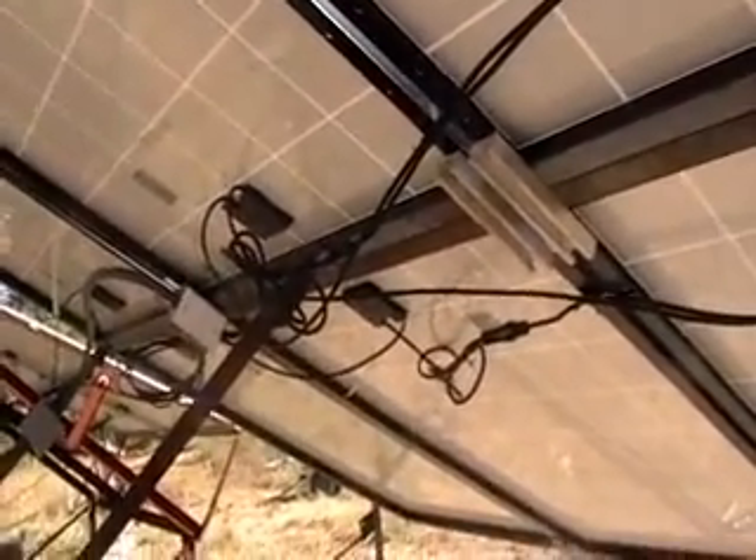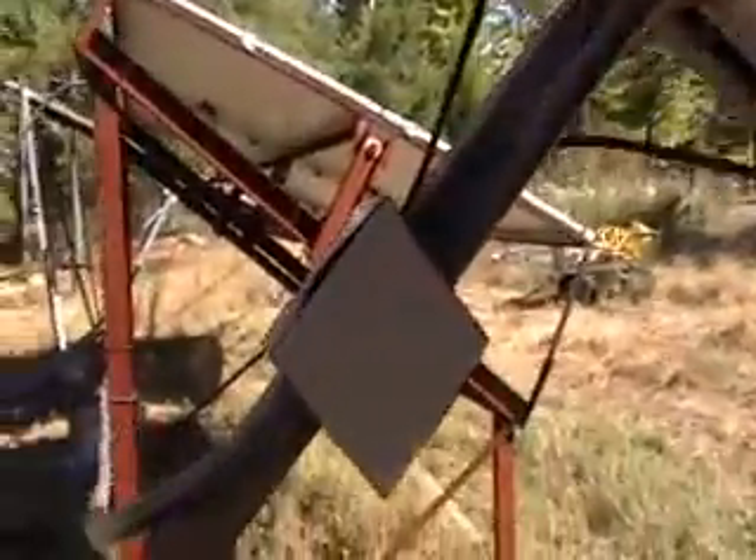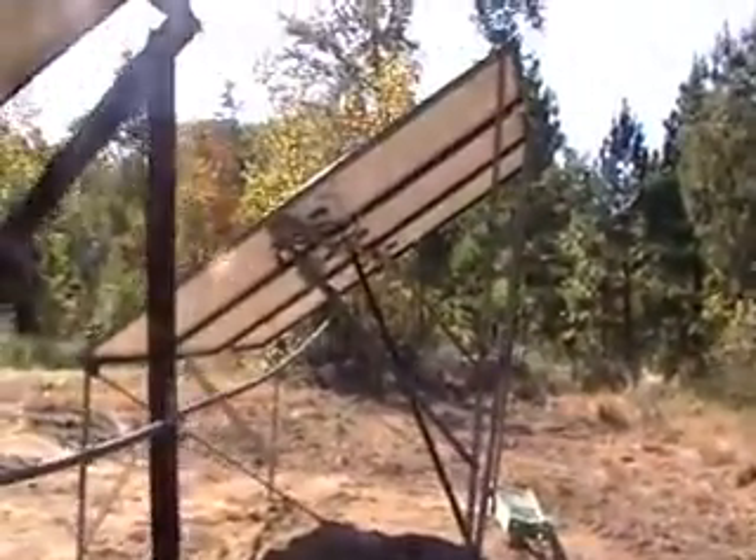There's six here, and I just have three groups of two wired in series, and those three groups of two are wired in parallel. I'm running it through a junction box and into my disconnect right here. I have each set of Kyoceras on one 20-amp breaker.